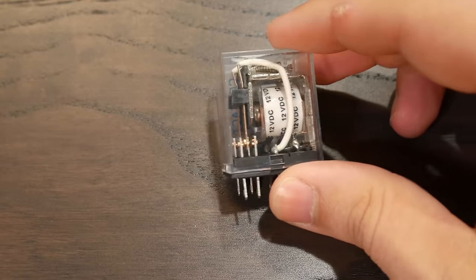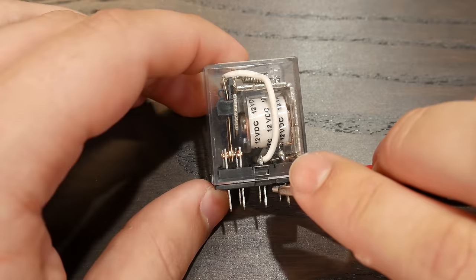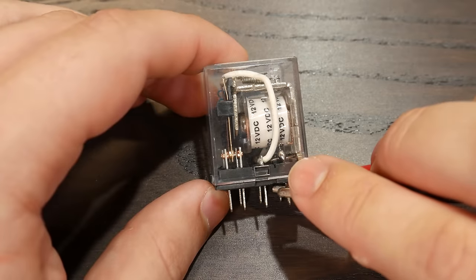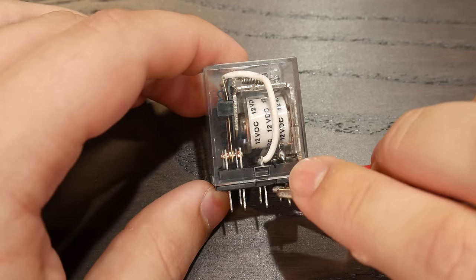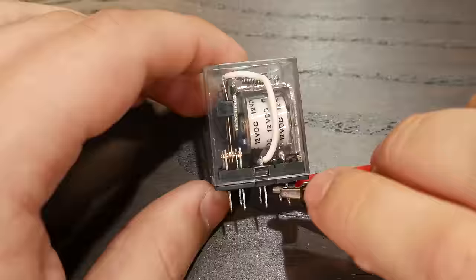Okay, so here's something that's super common in electromechanics and is gonna come up a few times here. Self-latching circuits with interrupts. Using a relay, we can design a circuit that will latch itself in a closed state until another action occurs. What is a relay? Well, a relay is an electrically operated switch. A small electromagnet within the relay opens or closes any number of switch contacts. One of the most common things we do with relays is control high-power devices with low-voltage, low-current control circuitry. But we can also be almost endlessly clever with them.